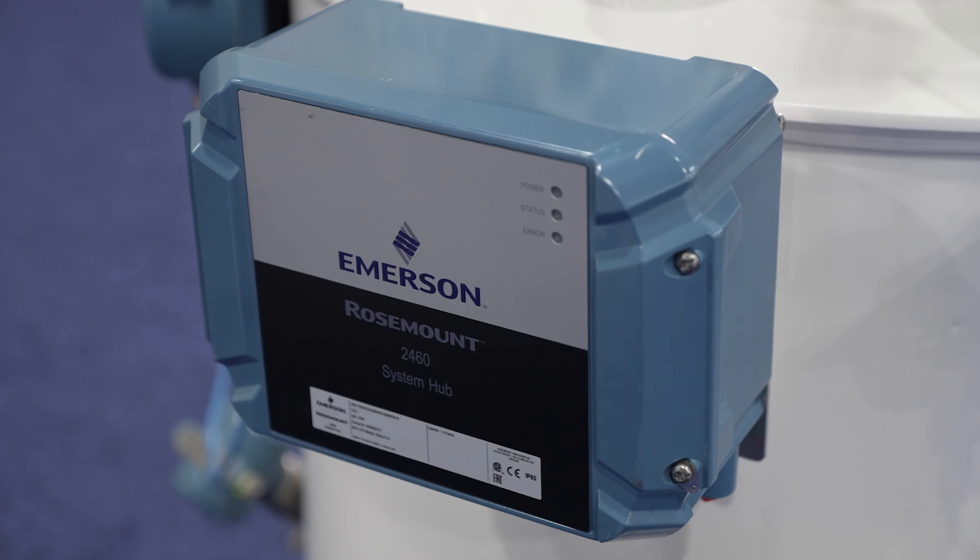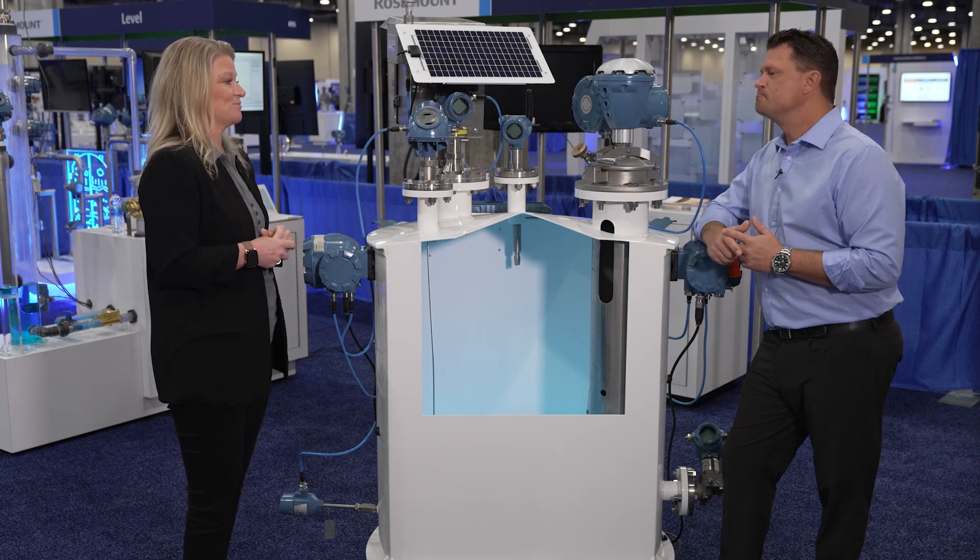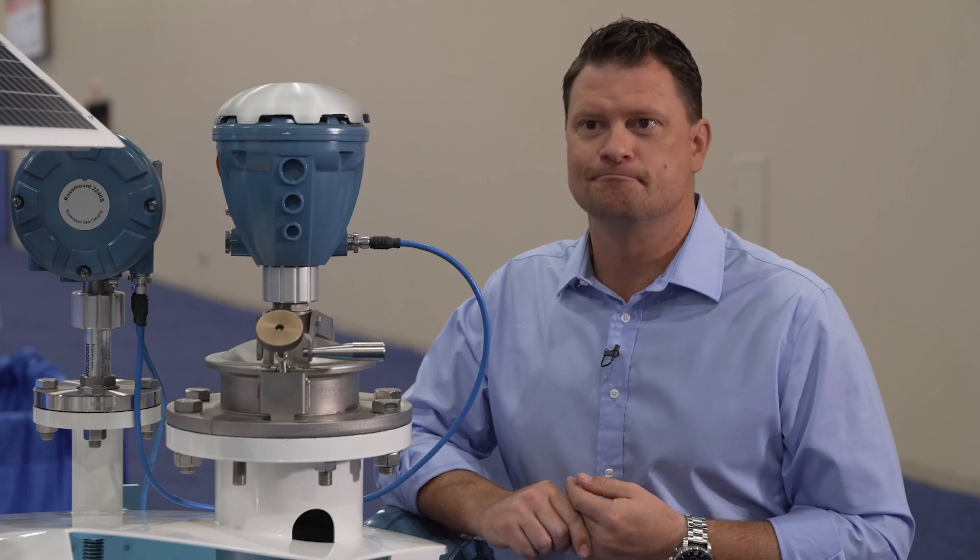The 2460 transfers real-time tank gauging data from field devices to the Rosemount TankMaster inventory management software or a host or DCS system. It's designed for larger systems and supports system redundancy and emulation of other vendors' devices — maybe not so relevant for the tank monitoring system as it looks today. The Rosemount TankMaster is a software suite with a configuration tool and an operator's interface, available in different levels, ranging from the tank server itself conducting calculations, to WinView, which is more of a monitoring application, and WinOPI, which is designed for tank gauging applications.